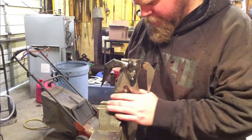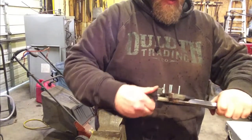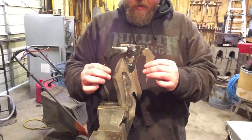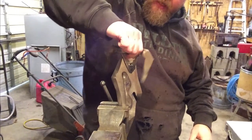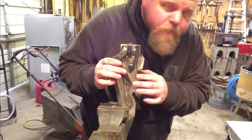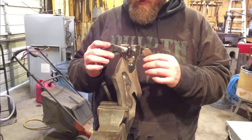Yeah, I don't know. It seems like it's awful stiff. Of course, we don't have a milling machine here, so tolerances are probably iffy. I don't really like how this one's sticking out. Got a little bit of backlash in the gears. Of course, heating them up with the TIG welder probably wasn't the greatest. So I'm gonna play around with some timing, scooting this in and out and stuff like that, and see if I can get them timed a little closer.